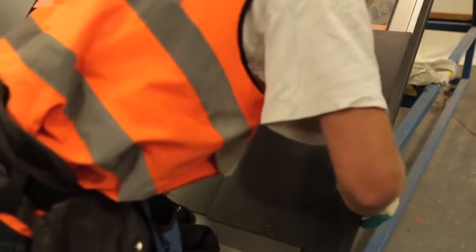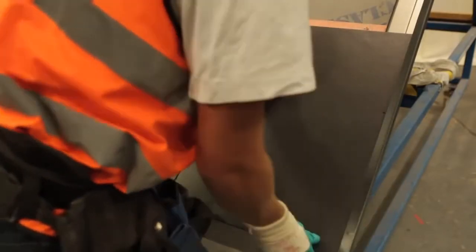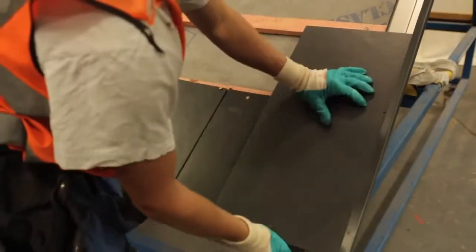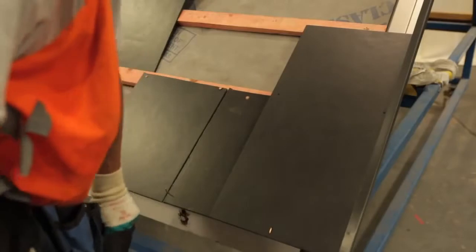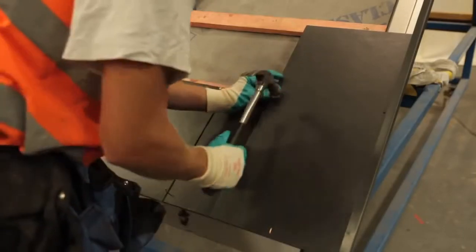As this is a low pitch roof, at hips you will need to use double slates beneath the hip capping. At valleys and hips where slates need to be cut on the rake, also use double slates to maintain an adequate width and side lap at the head or tail.